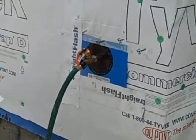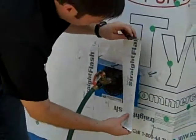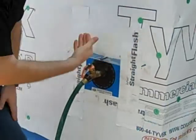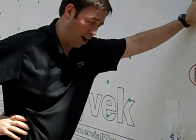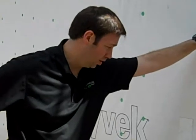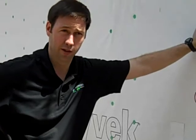One quick note about this: I see a lot of builders that use different products together. For instance, I've seen a lot of that silver flashing tape used on DuPont Tyvek. I'm a little bit concerned about that because I don't know for sure that the manufacturer is rated to use those tapes and flashings with other products. So whatever brand you use of house wrap, I'm a big believer in sticking with that brand through all their flashing — whether it's a flashing tape or a window sill pan flash you're making. Stay with the same manufacturer. I love the DuPont Tyvek family; I think they're great products. I'm not endorsed by them, I'm not getting paid by them — it just happens to be my favorite, and I really feel like it's the best product on the marketplace.